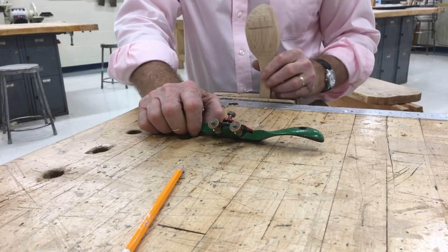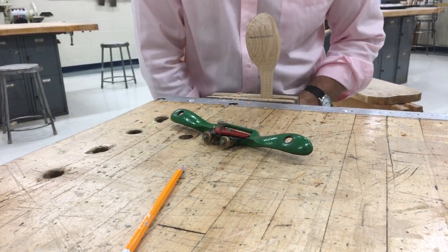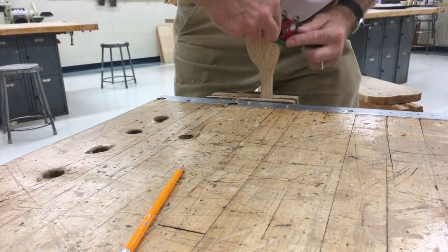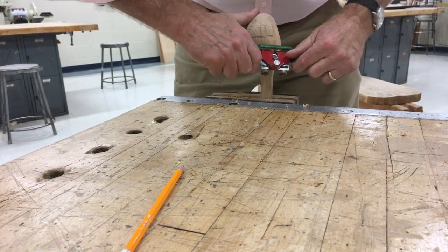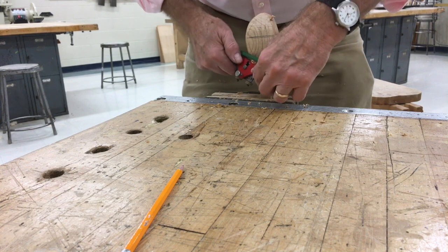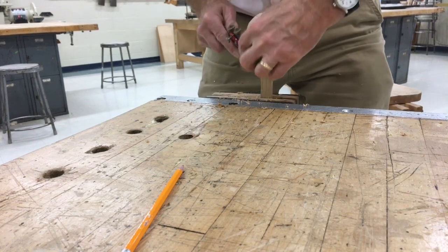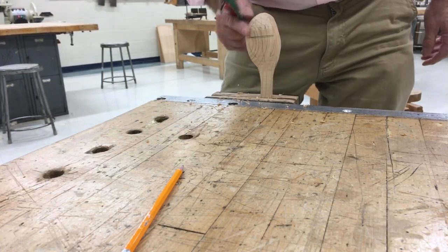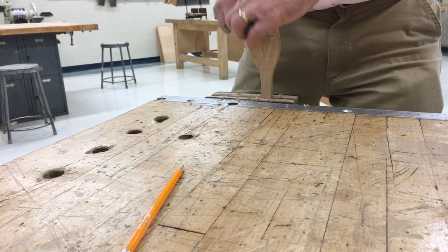Generally, I like to stand up when I do this — that way I can see a little better where I'm working. Another thing to know if you're going the right direction: if I'm cutting the wrong direction, for instance cutting up when I should be cutting down, you'll get a really rough cut called chatter. You can hear it, you can feel it. So if you get those chatter marks, you need to turn and go the other way. You can tell by the sound.